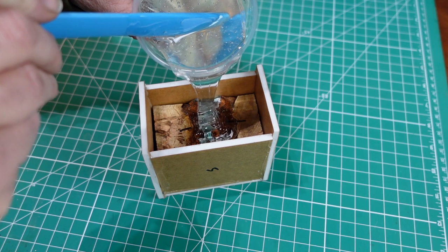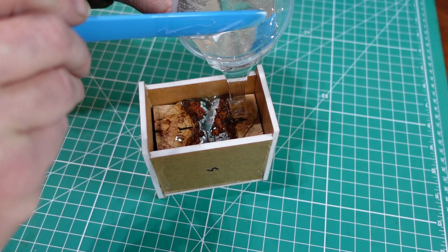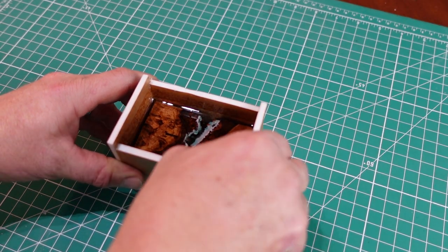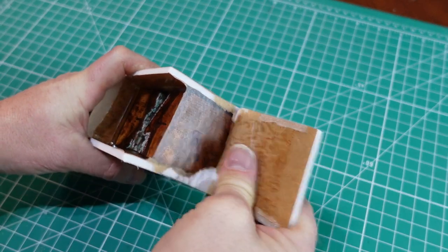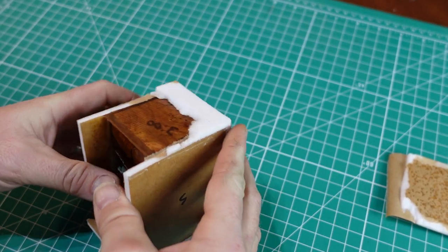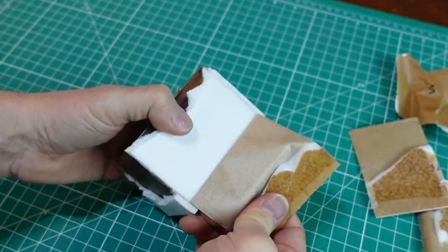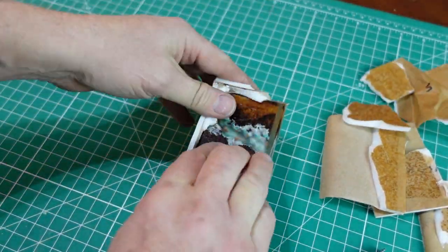For this project, I'm using Total Boat tabletop resin. I'm not doing a thick pour here, so I haven't had any issues with thermal cracking at this dimension. I do make sure to lay down extra in the mold since the bark is porous and will absorb a lot of it. After leaving the mold in the pressure pot for a day, I begin removing the water-resistant foam board. Most of it peels away cleanly by hand or with the help of a chisel.